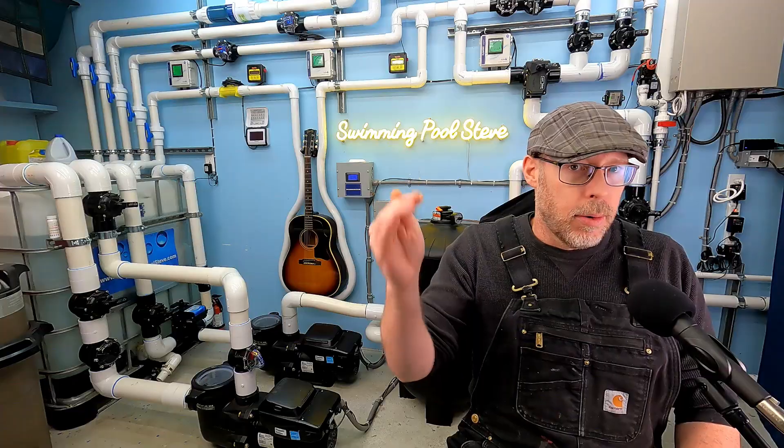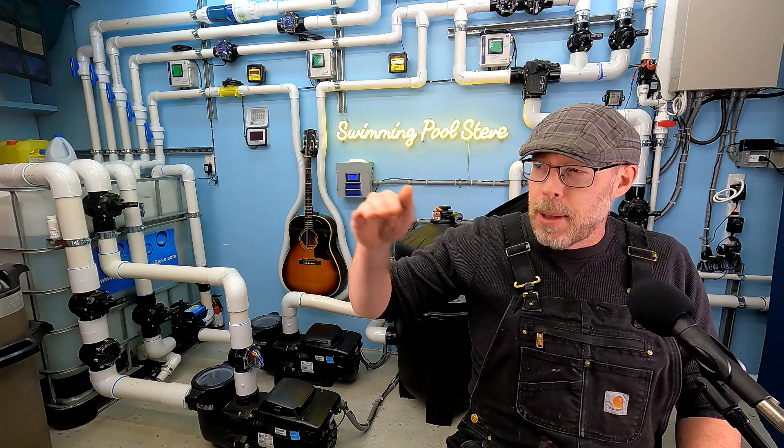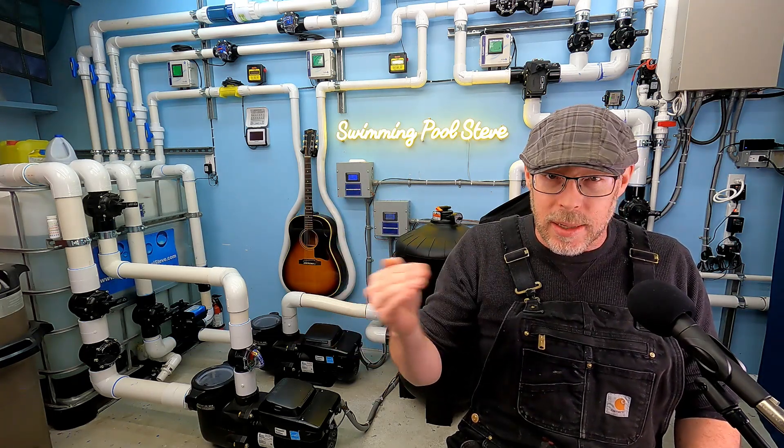This is a bone I want to pick: however thick the concrete is that your engineers or builders decided, if you run pipe runs inside of that space, we have a problem. That space was specified for structural concrete — its ability to handle strength and reinforce the vessel. Running a pipe creates a plane for a crack to develop because it weakens one area. PVC pipe is not strong and should not be taking up space that structural concrete needs. Even a non-builder can see: if it's supposed to be eight inches of concrete, we need eight inches — not five and a half inches plus a two-inch pipe, let alone in a six-inch thick wall.